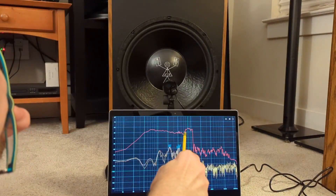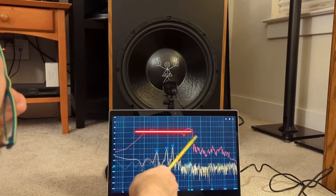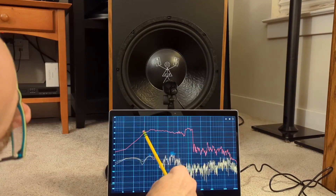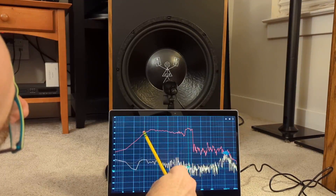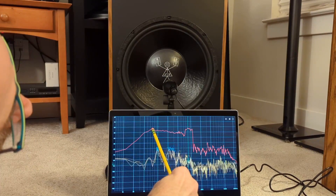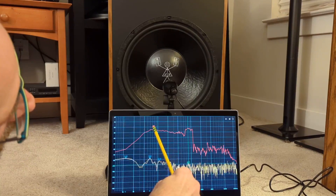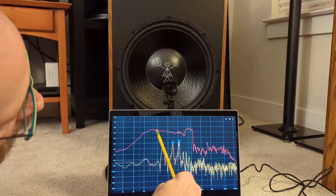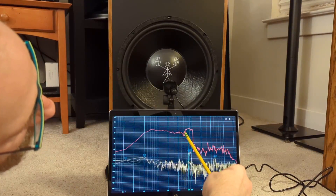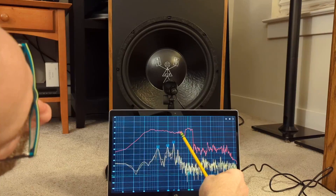Let's pick a datum here — a bass line. We'll go with the negative 30 line. If we choose that as our datum, this is 40Hz, so we're starting out at 40Hz. We've got about a 5dB bump here at roughly 60 to 70Hz, and then it continues along. This is quite literally plus or minus about 4dB all the way through.